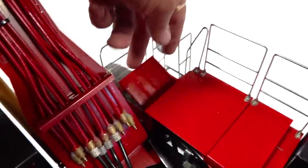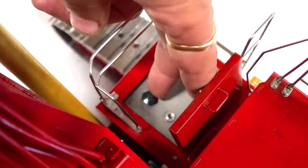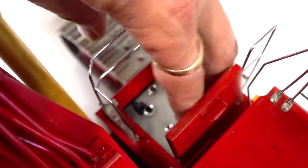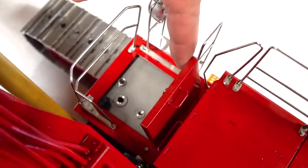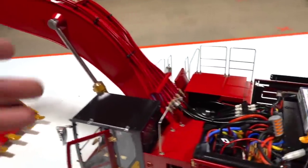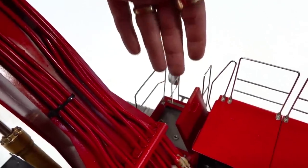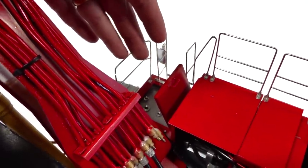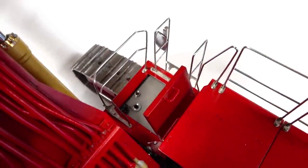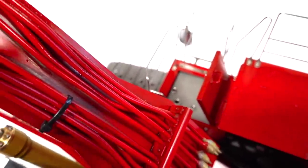Now this is the hydraulic tank, right? When you're actually filling the hydraulic tank, let me focus on that. This is the breather hole. This is actually where you fill it up. While you're adding fluid, make sure that you fill the tank up all the way to the top. But you don't want to have everything full, because this oil is going to expand with heat, and after everything is full in here already, you're only going to want about a third to a half a tank of oil in there, because you will have this shooting up, and if you're not careful, your mouth is open, you're going to get some in your mouth, you might squirt someone in the eye. I'm not kidding here, man.